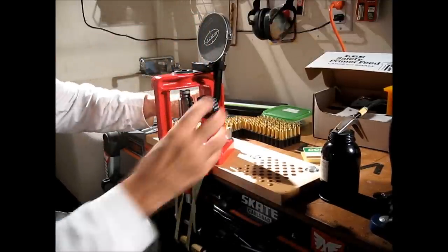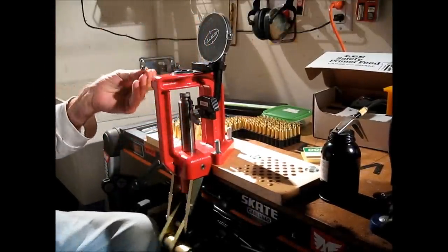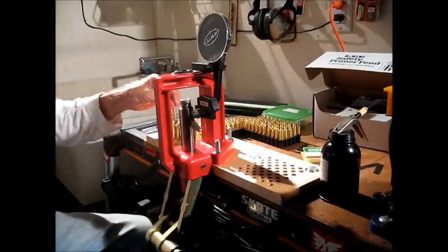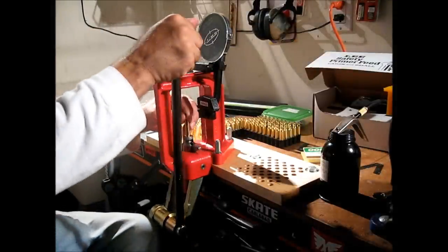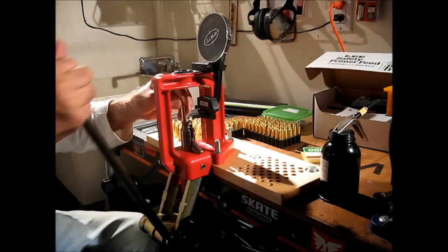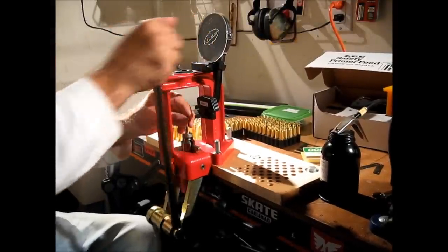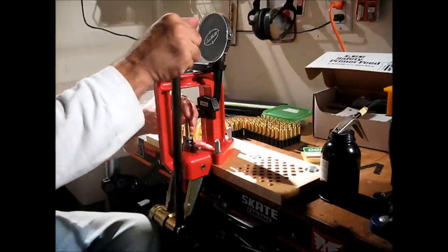Here's the whole operation — you can see you sort of pick up a rhythm. I could do 500 in very short order. Just inspect: they're going in snug, sitting flush to the base. You don't want them sticking out because you can get a slam fire. You don't want them too deep because they will not ignite and it won't cycle your semi-automatic weapon. I've had that happen. Just go at it with patience and precision. The single-stage press works much better than handheld varieties — you get a lot more force with a lot less effort. You can do 500 of these in a short time, no calluses, no soreness.